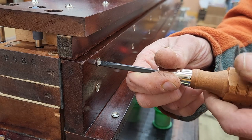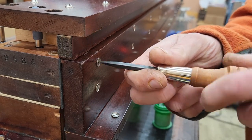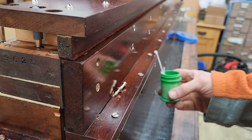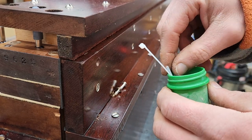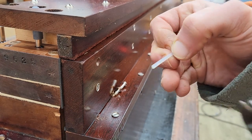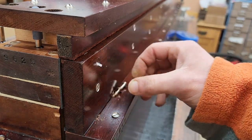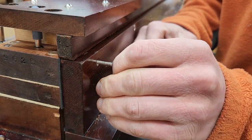Okay, I've assembled it again, and I've got a stripped screw. And instead of taking the thing all apart again, which I currently don't have to, thank goodness, I'll put a band-aid on that stripped screw hole by putting a chunk of zip tie in the threaded portion of the hole, just here. Instead of a toothpick, these zip ties stay together much better and don't shred. I actually save zip tie trimmings just for this purpose. What? My grandparents grew up during the Great Depression. I can't just throw things away willy-nilly.